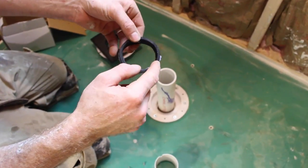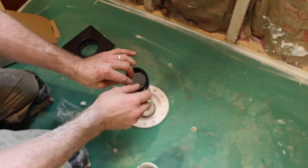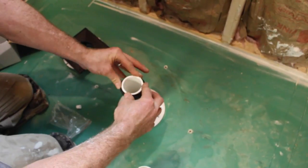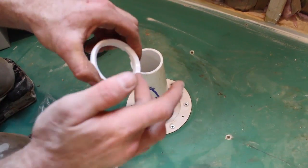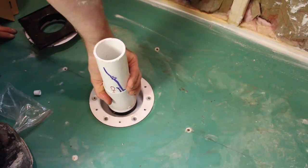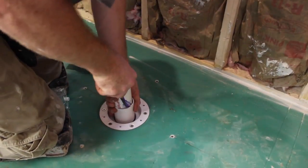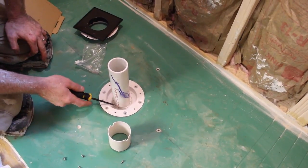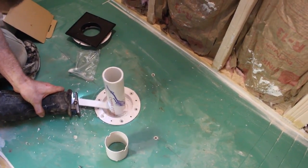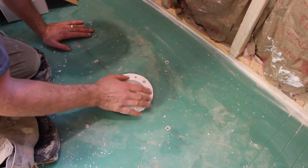Everything in the drain assembly comes with the VIM kit. You put a bead of silicone underneath the drain piece and on top of the recess — but not in the holes of the VIM pan — then compress it to seal against the pan. It comes with stainless steel screws to secure the drain. There's also a rubber gasket — apply grease to it, with the beveled edge facing upward, just like with a WEDI shower pan — then push it down into the recess between your pipe and the drain.